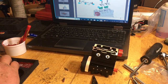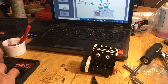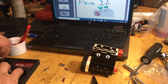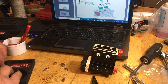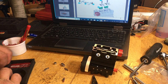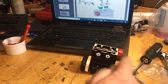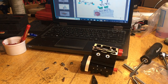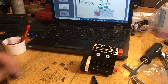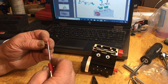And here's what I do. And I know a lot of people are gonna say, why do you do it? But I'll tell you why. I'm gonna stuff these full of grease. I'm gonna smash them down on there. Because once this engine starts, the likeliness of any kind of lubrication getting back up underneath that is going to be slim and none, because there's no pressure in the head other than the camshaft moving. So this is what I do, guys. I completely stuff these full.